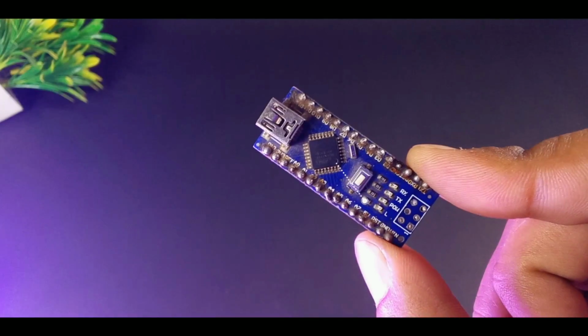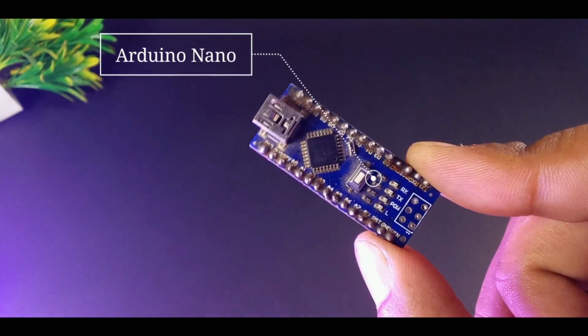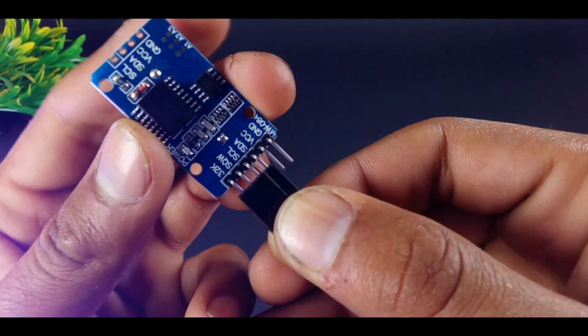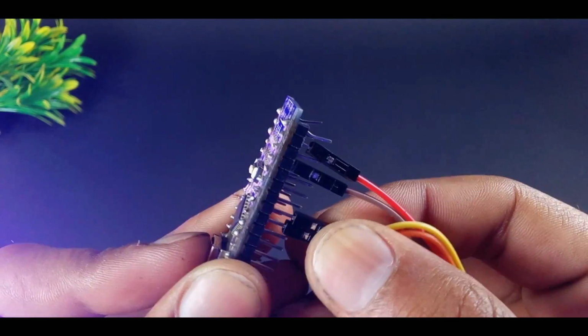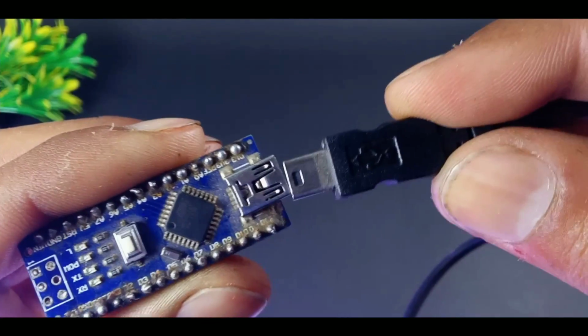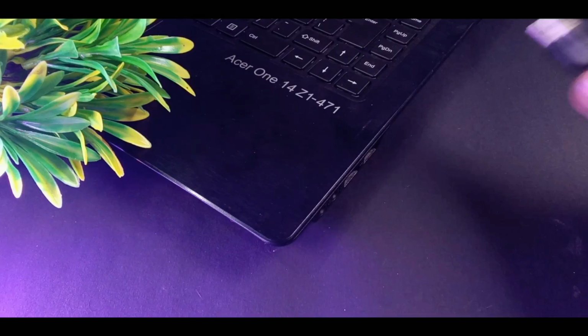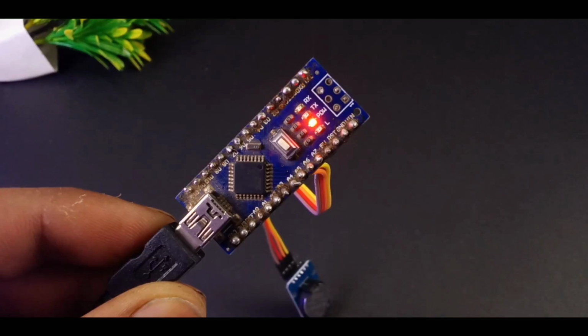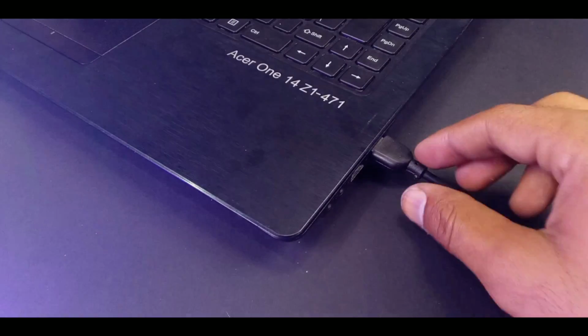Here, I'm using an Arduino Nano, which is the brain of this clock, and also using an RTC module to give real time to the clock. At first, connect the RTC module to the Nano with the help of some jumpers and move towards the coding process. The coding process is very simple. All the files related to this project are given in the description, so go and check them out there. Finally, our code is uploaded into the Arduino Nano.